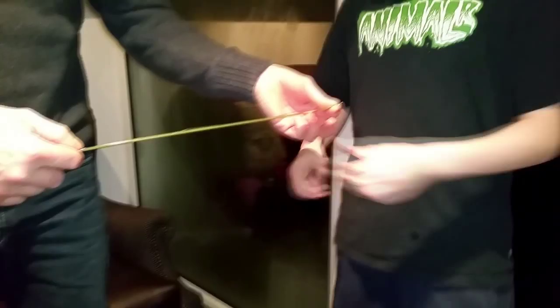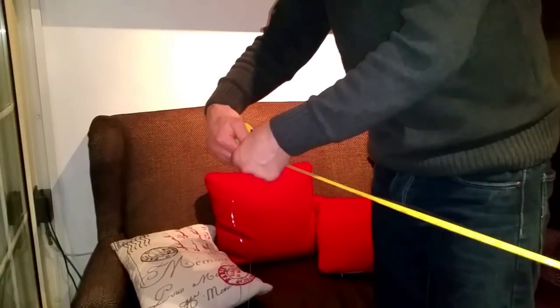We're going to start by measuring and cutting our conductor. I'll use my son here to help hold it — hold that end there and go over to there, because I've got to measure it out to just over 1.8 meters, say 1,850mm. Now we've got our first conductor, but we're going to use five of these. The 0.6mm wire will make a conductor of 3mm, so I'm going to cut another four of these.